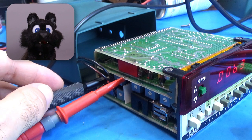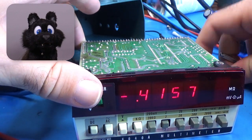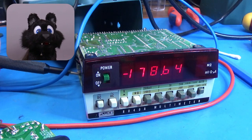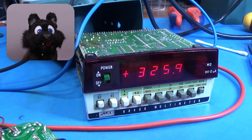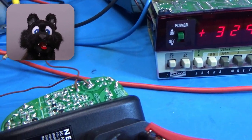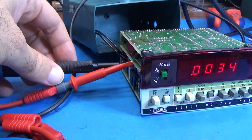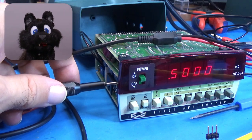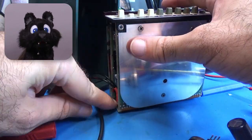And now — calibration! I have no voltage standards around, so I have to use whatever I can get that is close to the requested values and make sure that the Fluke shows a value that agrees with my cheaper but much newer digital multimeter. I mean, who but Dave Jones has 750V, 10kHz voltage standards in their junk box? And this is Austria, not Australia, so I can't just hop over either. After adjusting every parameter I could — being especially proud of the 1V AC 200Hz measurement — I slid the unit back into the case.